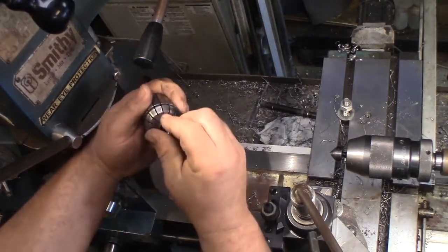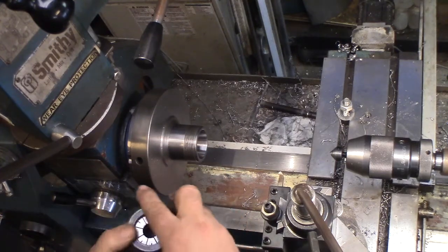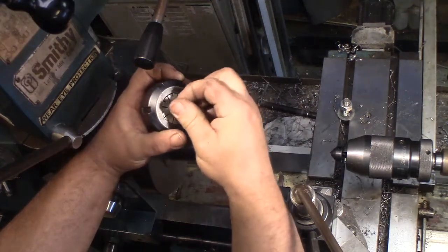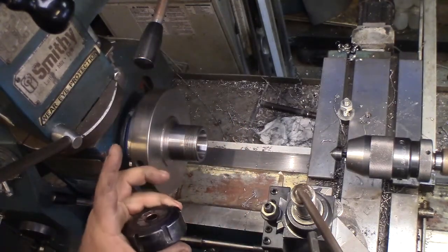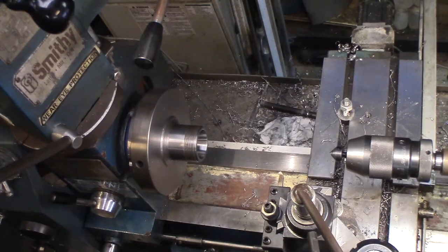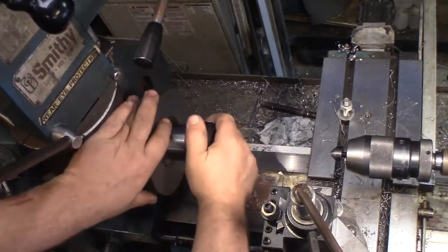Okay, so that's feeling nice again. Alright, so grab one of our little crimpy rings, and that's too big, so we don't want that one. Grab this one. So put in a nut first, because if it expands out, you'll never get it in. And then we take our second one, which was here just a moment ago. Yeah! Well, you know what I'm going to do with it. I'm going to shove it in the hole. Just like so, but maybe not that far. I have it sticking out just a little proud so I can work with it. I had two of these rings right here. Well, that's why you buy 100 when you need two, because they just walk off. Okay, we'll stick another one in the back to equalize our clamping pressure. May not be needed, but some things I can be anal about. Just give that a snug.